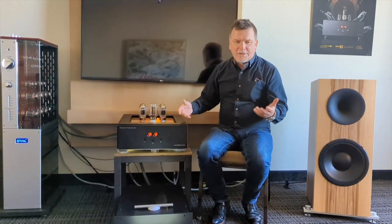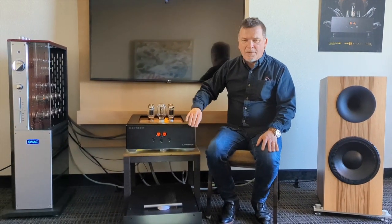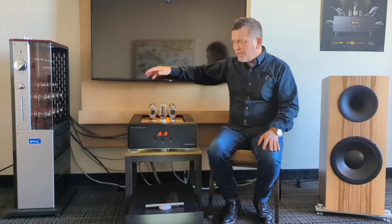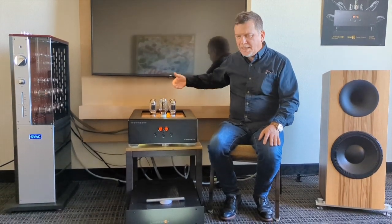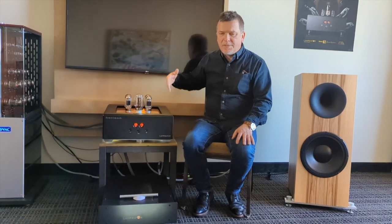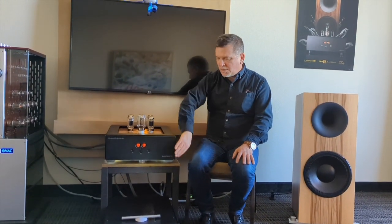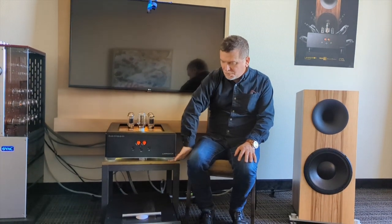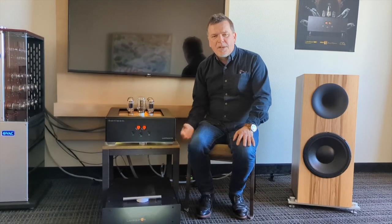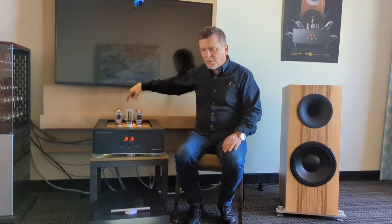It is a very attractive feature that many people appreciate, that our DAC is made without screws. So there are no visible screws anywhere, on the top, on behind, on the bottom, anywhere. So not only there are no screws visible, but those that do hold the piece together are invisible. They are covered by the footers, by the so-called legs. So you have to gain access to the bottom, remove the legs, and then you will gain access to the big pins that hold the whole piece together.